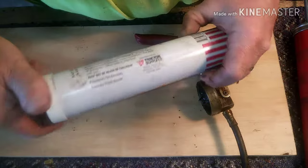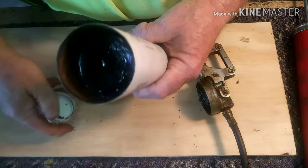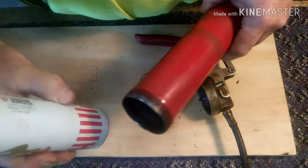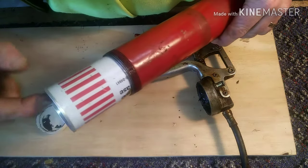Get the old can out of there. New grease — this is just basic generic grease. There's a pull tab end and a plastic cap end; the cap comes off — that's the bottom. It helps if you store those upright. The open end goes down into the gun, so just shove that down in there until it can't go anymore.